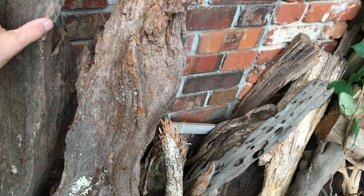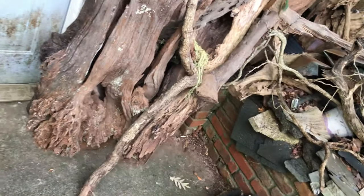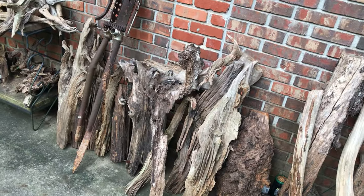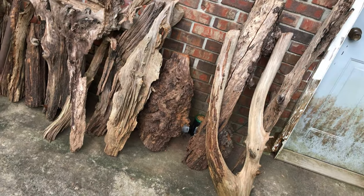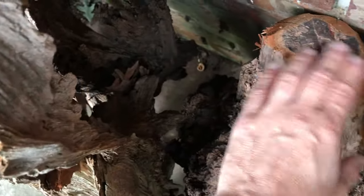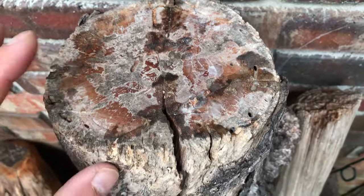It took me forever to haul it out — a lot of work. It's easier if you have a boat or friends that can help, because this stuff gives you a workout, especially if you find it in the mountains or if you have to hike with it. I love burls. Here's a beautiful cherry burl — I finished part of it. I've got to put some more wax on that because it's checking. Here's one with wax on it — it's still checking, but that happens sometimes. You need to work with the character of the wood. Some nice oak burls, some more pine heart — that's mainly what I find in the southeast.